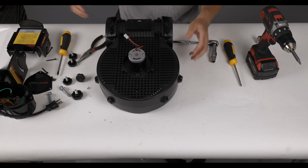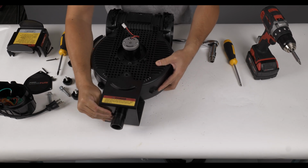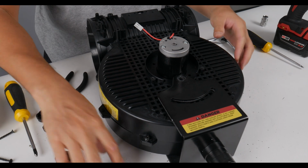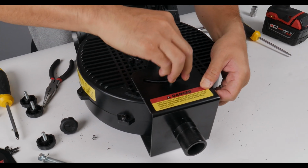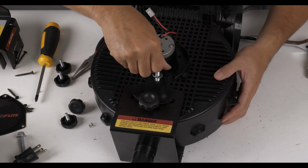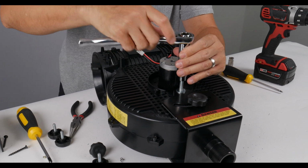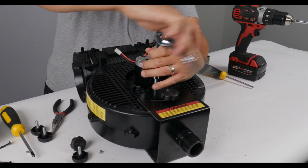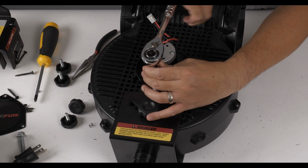We'll slide in the tilt bracket on the bottom, making sure that the slot lines up with the thumb screw knob. There's the groove right there, making sure it lines up with the insert hole for the thumb screw. We'll use this to center everything. You can keep it loose, doesn't need to be very tight. It's just to center it. We'll put in the 12mm bolt. And tighten that down. Again, you don't have to make it overly tight because it will make the bracket hard to move.